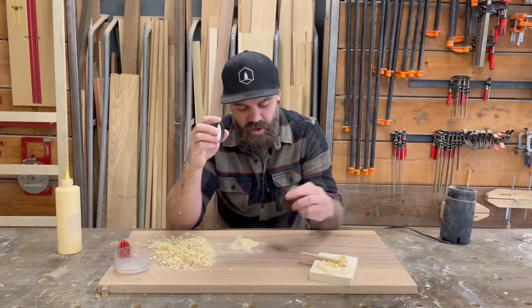If you've seen me use setup blocks to set the blade height on my table saw, there is one problem — it's hard to find the dead center of your blade, because it's at dead center that your blade is going to be the highest. On my other saws I mark a line on the insert or even on the table saw itself that is dead center of the arbor, so that's the tallest point of the blade. That way when you use a setup block, you put it right on that mark. But how do you find dead center accurately? The instruction manual might give a measurement, but I don't trust it. The only way to get an accurate interpretation is to actually cut something and see where it lands.